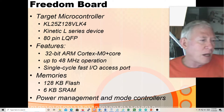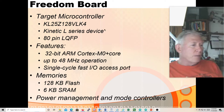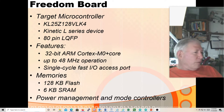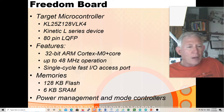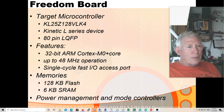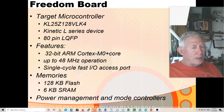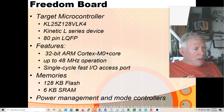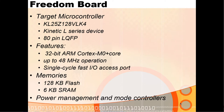One of the main features not implemented by Freescale in this KL25Z chip is that they didn't implement having two stack pointer registers — there's just one stack pointer register. It does mean it's a little less powerful when you use it with a real-time operating system. That's about the only downside, and even in Micro 2 we never really use it with a real-time operating system.